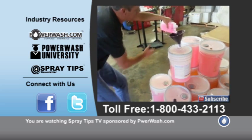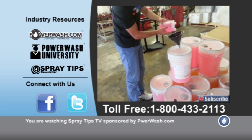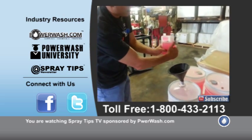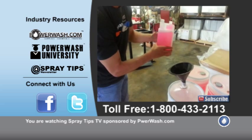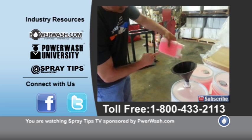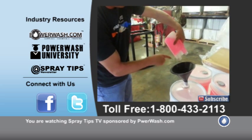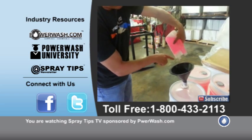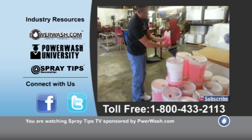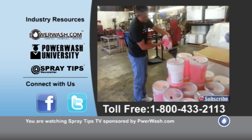Because what happens — see as I turn up, it opens up. I'm going to do it again to show you what happens if I do it the other way. Fill it up. Now if I turn it and go this way, notice that it starts to run down this tube and starts coming in here, so my measurements get off. Even though I've got a vacuum on it, it still squeezes down and rolls out. So that's the correct way to actually use the proportioner bottle — is to pour against the flow there.